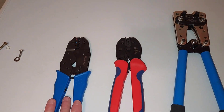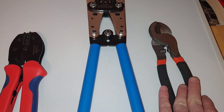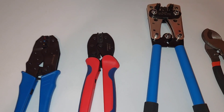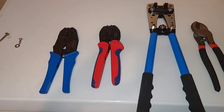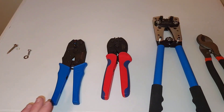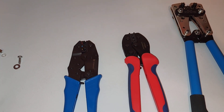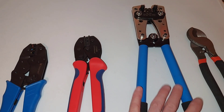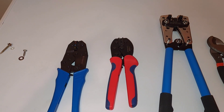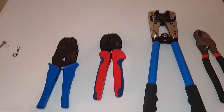The total for the lithium battery upgrade was right at $1,650, and that includes crimpers for the cables and connectors. I bought some cable crimpers for the 2-ought cable but ended up not having to cut those. That total includes all taxes — cables, solar cables, MC4 connectors, connectors for the number 10 wires and number 6 wires. Everything worked great with no trouble. My actual out-of-pocket was a few hundred dollars less because I had Amazon discounts, but the total tracked expense was $1,650 for the battery upgrade and $566 for the solar upgrade. That's it for this video — talk to you later.